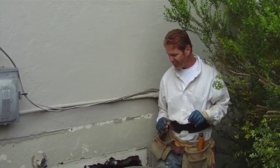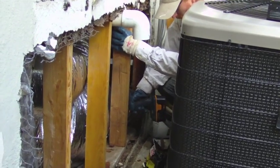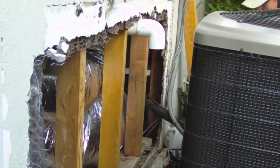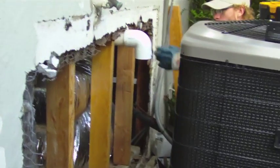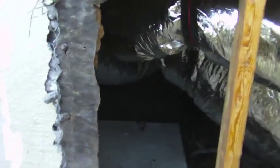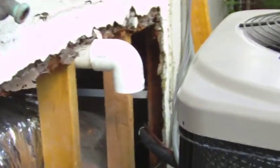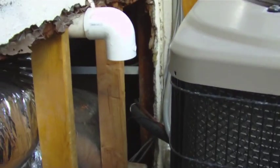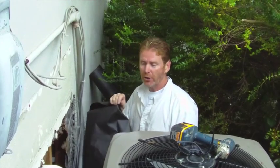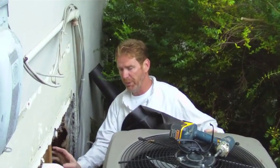He's putting the last stud in. We still need to break out that right side — it's kind of like sheetrock, we want to put our joint directly on the stud. Here's our first stud, then we go every 16 inches to the next stud. Go ahead and do the breakout over there, then put the last stud — we'll sister it on there and start the paper and wire.